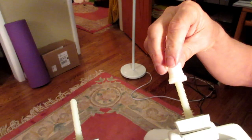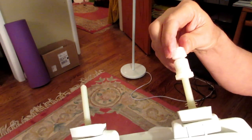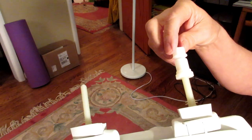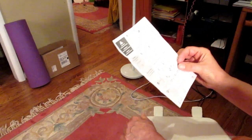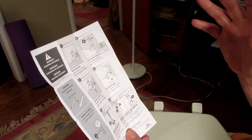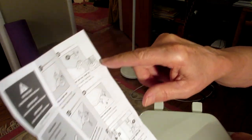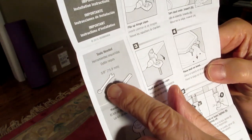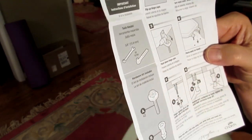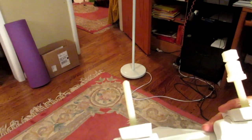We'll tighten this with a 5/8 inch wrench, crescent wrench, or socket wrench, and tighten until the little break-off piece actually pops off — that's what the instructions say to do. The instructions that come with this are great. The only thing not quite clear was it doesn't say it will snap, but it shows you the picture. You'll need a 5/8 inch wrench or socket wrench or a crescent wrench — whatever works for you. This looks like the world's easiest job; I just hope I got the right toilet seat.